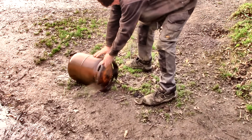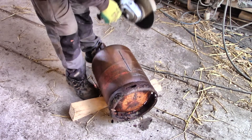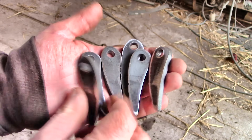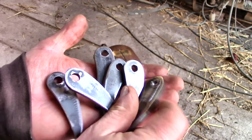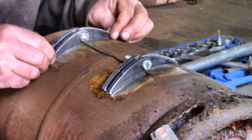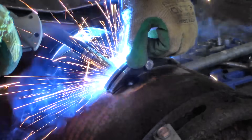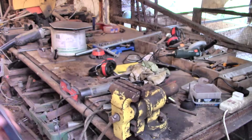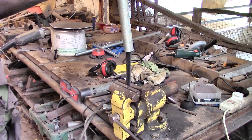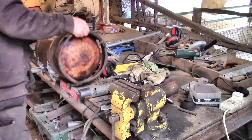I fill them with water overnight so the gas is all displaced. I cut the hinges and the latch parts with my CNC plasma cutter, but they're just simple shapes so you could use an angle grinder. They go on before the door is completely cut out so the door stays in the right position when fitted. I curved the latch so it would fit snugly around the curve of the door.